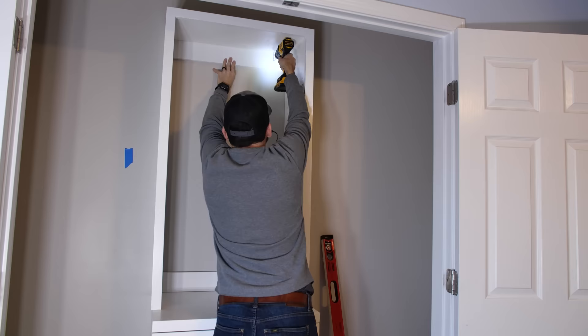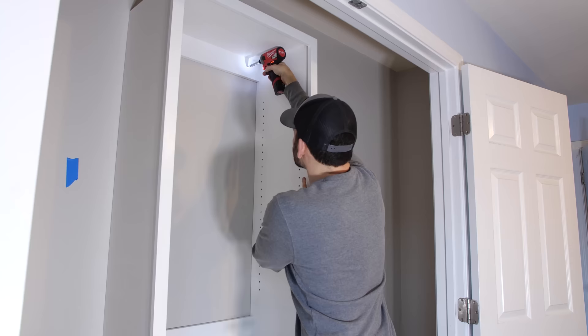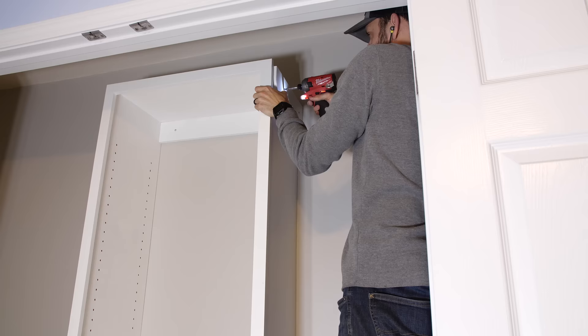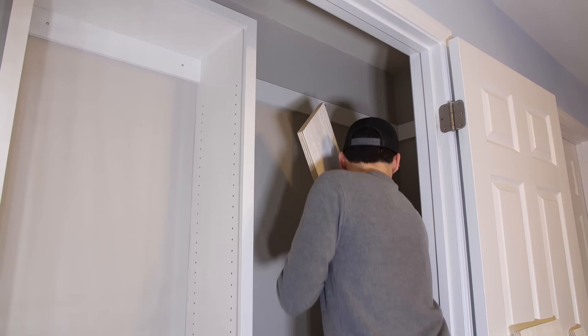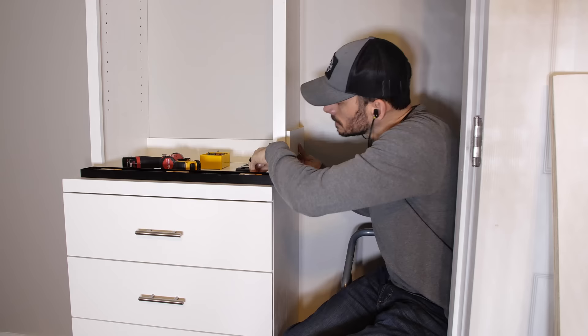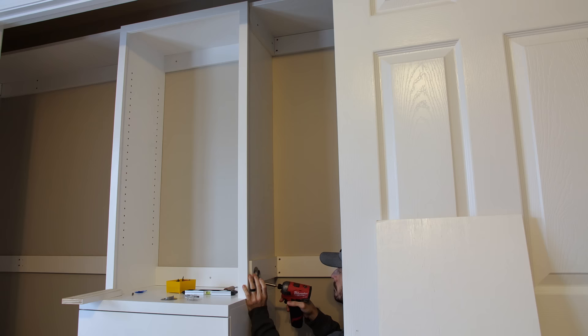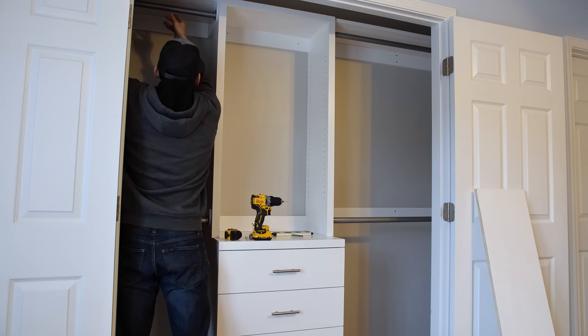After leveling the unit I secured the hutch to the wall again using wall anchors. From there I attached the upper and lower shelves using a cleat on the hutch back wall and side wall. I made the top shelf flush with the top of the hutch for a continuous upper shelf for long-term storage. I went with two bays of short hanging on each side since my son doesn't need long hanging right now — but you could easily remove the lower shelf on one side for upper long hanging with a shoe rack or shelves below. I installed brackets to hold the metal rods, then cut the metal rods to size and put them in place.